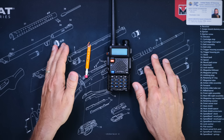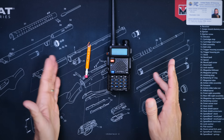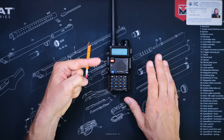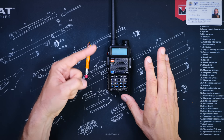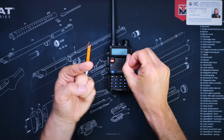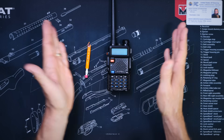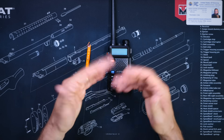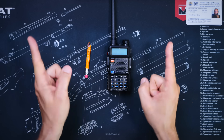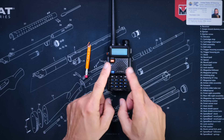To get a repeater tone, you do not simply scan the tone while listening to the repeater. This is a big mistake that many people new to the exciting and dynamic world of radios often make. Scanning the tone while listening to the repeater will give you the repeater's output tone. The output tone is the optional tone that can be used to limit noise while listening to the repeater, and it is not necessarily the same as the input tone. It is the input tone that your radio needs to transmit to the repeater to make use of it. To get that input tone — the tone that actually activates the repeater — you must scan the input frequency of said repeater. To do that, you must be within direct radio range of someone that is currently using the repeater. You can then use the tone scanning feature available on most radios, which I will show you in the upcoming third half of this video.